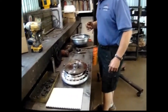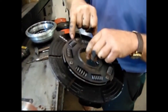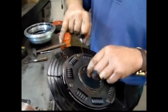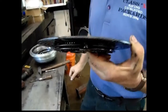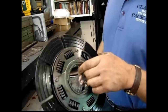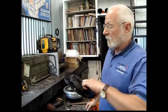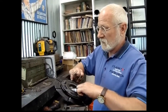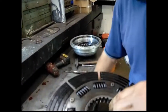I'm going to have to send and get a different high-range clutch — it has to be relined. That used to be easy, but now with EPA regulations and everything else, it's hard to find someone to do them. That's a bit of a headache. But I've got to have one because I can't put it back together with this thing in here. You can feel it — it's as hard as the steel table.